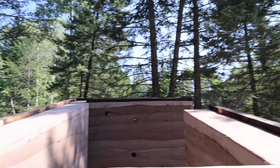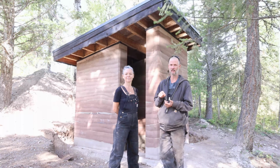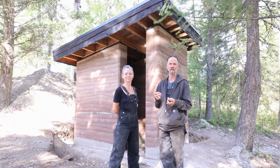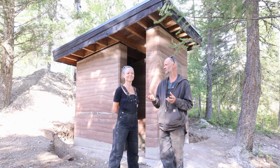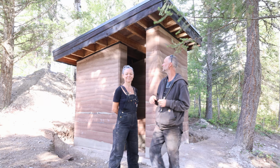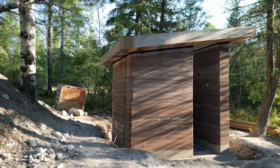And this is then fastened to the rammed earth walls with wedge anchors, or you can use nails and wire. We've done both those in the course, in the workshop, showing people how to do each one of those fastening methods to essentially the concrete. I also show Shou Sugi Ban, the Japanese method of preserving wood, on that material, because it is exposed. You can sort of see it behind is the black shadow line below the roof joists, which is the next thing that we put on.